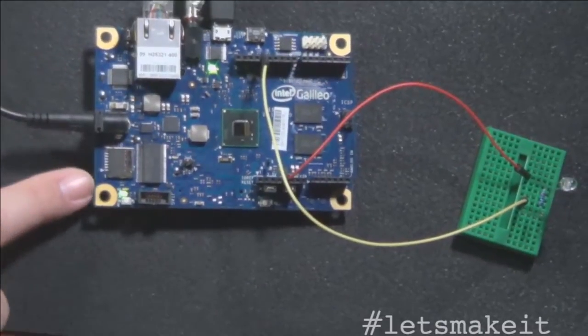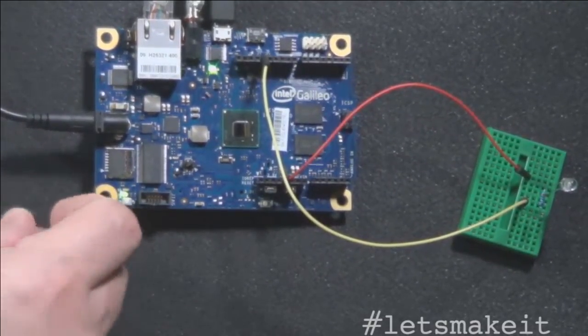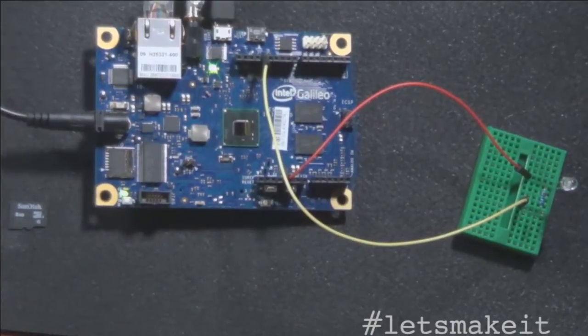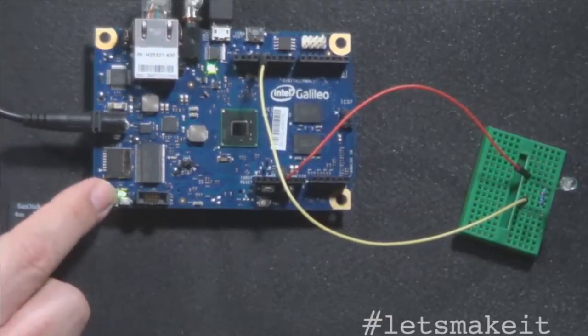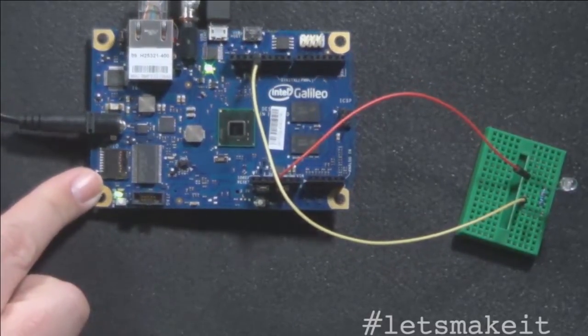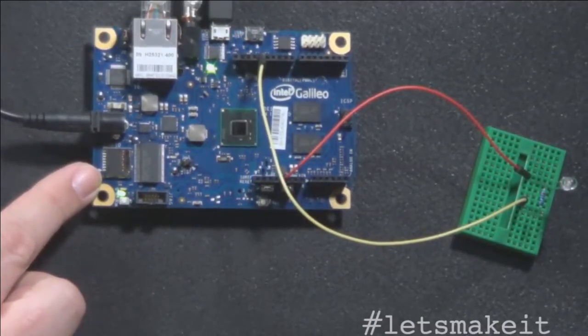You can also see right here there is a mini SD card slot. I have a mini SD card for this one sitting right here. I'm going to say you basically have to have a mini SD card. If you don't, when you turn this off whatever sketch you uploaded to it is gone. So if you want to save your sketch so it's there when it comes back on, you have to have an SD card. There is no other option.